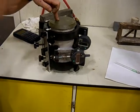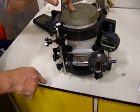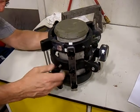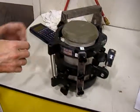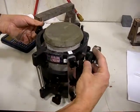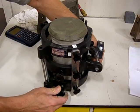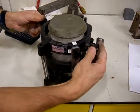Are you just interested in the Young's modulus, or do you want the Poisson's ratio too? I need both of them. So what we need to do is tighten up the middle ring as well — we'll just turn the two screws in the middle ring. Once I've got all seven of them — these two, these two, and the three in the bottom — and once they're all touching the sample, I just go around and tighten them all up a little bit so that the points actually dig into the concrete. Don't over-tighten them, just snug them up.